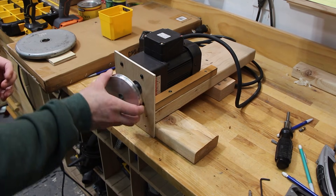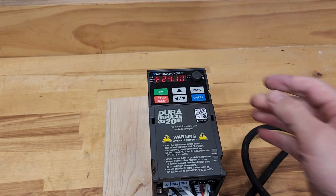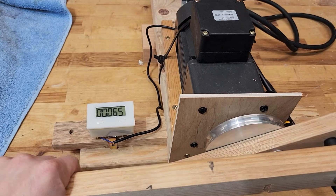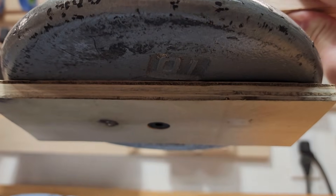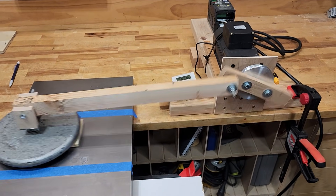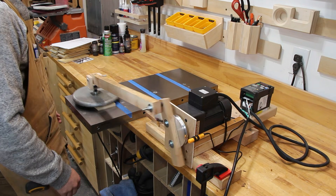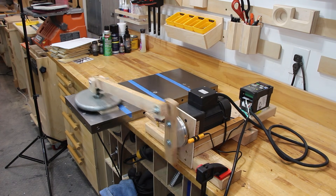In order to test this effectively, I have built a machine here to test wear cycles on each of these surfaces. I've automated it with the help of a friend using a motor and a VFD, or variable frequency drive, which controls the speed of the motor and allows me to optimize the RPMs. I've also connected a counter to show exactly how many cycles have been completed in each section. At the end of the arm there's a piece of rough low-grade plywood providing abrasion on the cast iron, with a 10-pound weight sitting on top. I'm switching out the plywood coupon for each run to avoid cross-contamination. We're going to apply 500 cycles on each section — one cycle slides the board out and back, which is essentially two passes across the surface, simulating sliding a board over your table saw a thousand times.